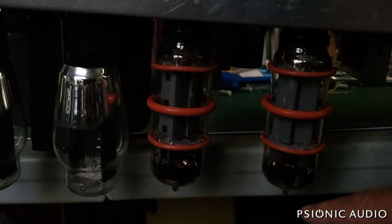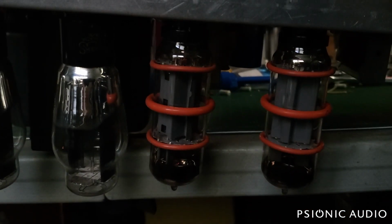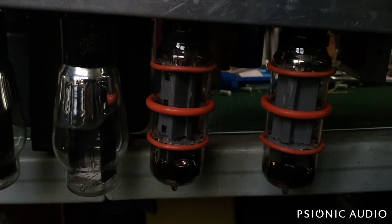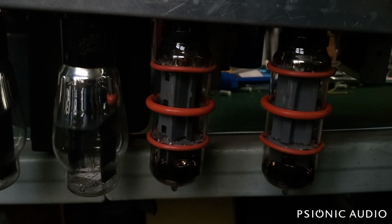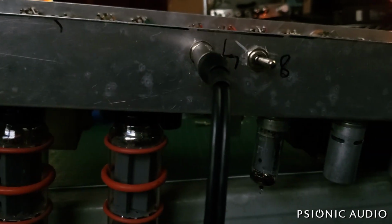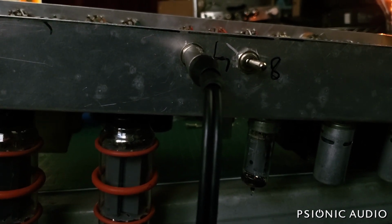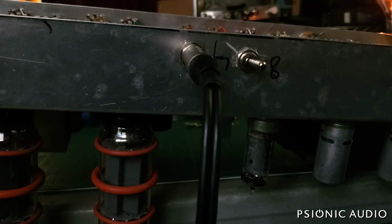Now, I haven't looked. I assume these are 6L6s, and I'm wondering if the builder had just stuck some old tubes in there, because based on everything else I see in here, he seems to believe that something old is intrinsically valuable and good just because of its age. Because a 6L6 should not need these dampening O-rings. So he probably had some old microphonic ones and stuck those on there and just sent the amp out into the world. And it's just a level of build quality that I don't subscribe to. So I'm not going to beat myself up making this thing great. I'm just going to make sure that it's not going to blow up again on the owner. So it'll sound like it sounds again.